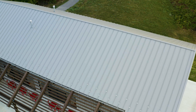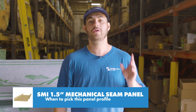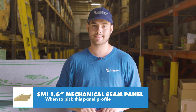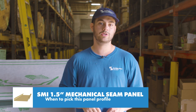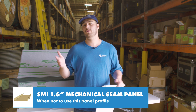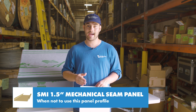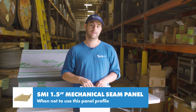This panel is a good choice for residential or commercial applications with slopes at or above a 2:12. If the conditions are right you can go lower, but remember to check with Sheffield Metals for approval and instructions. It's also a good choice when you want an engineered assembly, if you're interested in a commercial weathertight warranty, or if your roof has hydrostatic conditions. Don't use this panel over open framing, when you don't want to use extra labor for seaming as that will drive up the time and cost, and it's not a great DIY panel because of the seaming required.